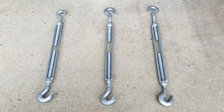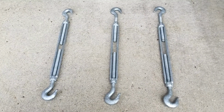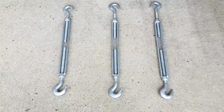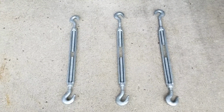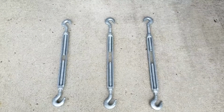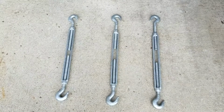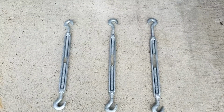We want the guy wire to be really tight, level with the pole, the mast we're going to be putting up there. We want to make sure we have a stronger tower for our wind turbine. Maybe it's going to be one tower, but when it gets up there, we're going to split it. One pole is going to be like a J pole facing the other way, and the other turbine is going to be on an extension pole or extension rod, like a pipe, welded, with the two turbines on the tower. One is sitting upright at the top, and the other is a little bit down, maybe 3 feet.